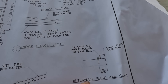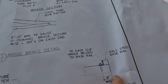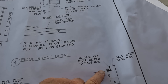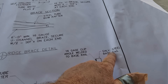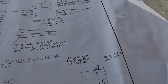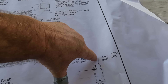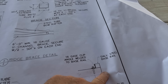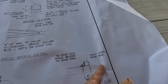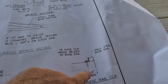Here's one option: the base rail clip. Here's the outside edge of your foundation, and here's a little angle iron piece that holds this rail. This is your galvanized steel base rail that goes all the way around the building — this is what holds it to the ground. You can't really drill straight through because it's too close to the edge; these are expandable, so if you go here with the bolt you're going to break the concrete out of the side. That's why they're offset over here.